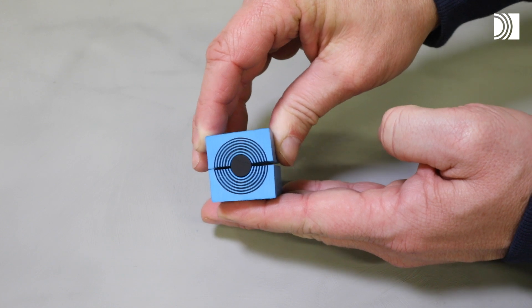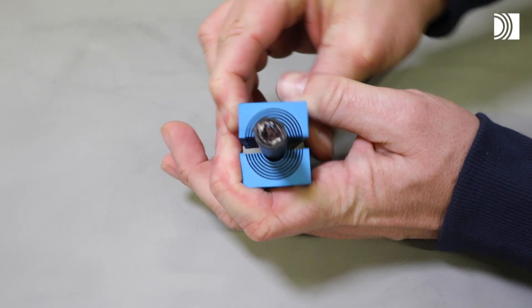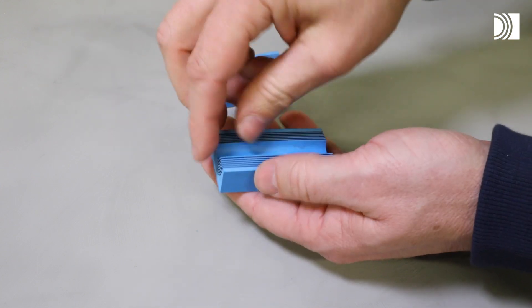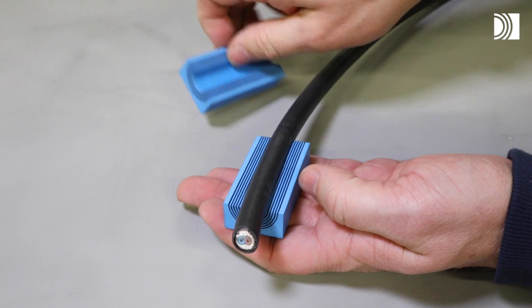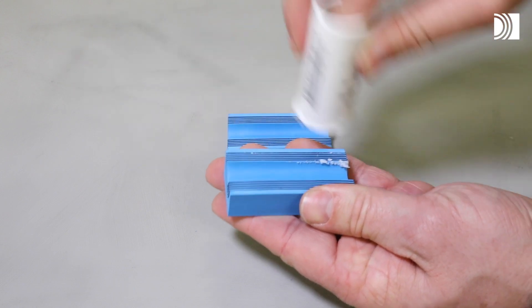Adapt the modules. Start by peeling off the layers to achieve a 0.1 to 1.0 millimeter gap between the two halves when held against the cable or pipe. The number of layers may not differ by more than one between the corresponding module halves. Lubricate all sealing surfaces on the modules.